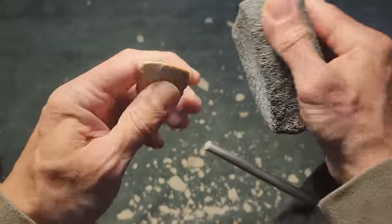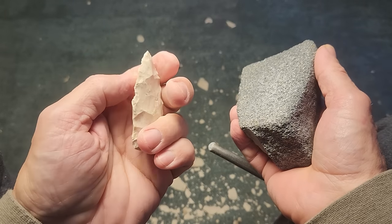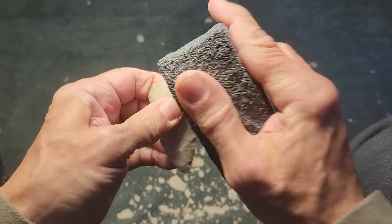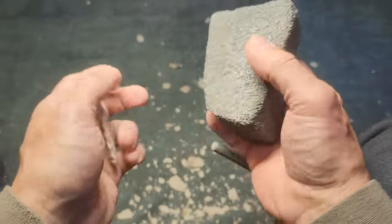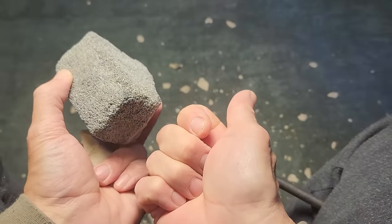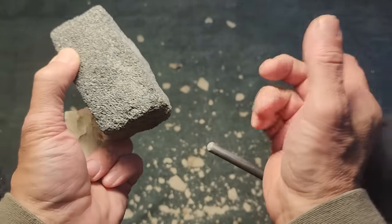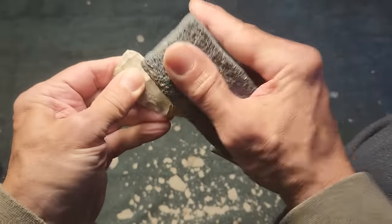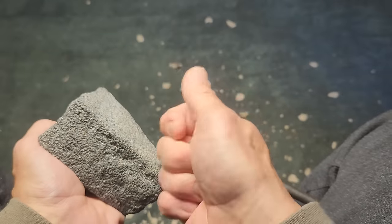On my old turkey roaster, the temperature was 50 degrees higher during cold weather, and almost 100 degrees higher in hot weather from what the dial indicated. So mine went up to 450, but in the middle of summer, I maxed it out at 450, and the actual temperature with the temperature gauge would show 550. But when I first started doing the heat treating, I would use the roaster gauge.